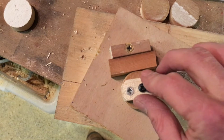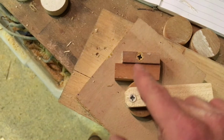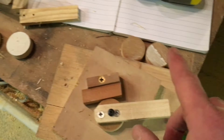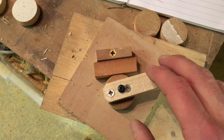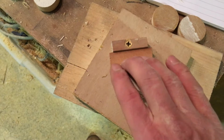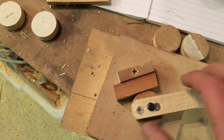So yeah, that's what I'll do. I'll set up on the curved piece, the steam bending part, once I've finally bottomed out what the curve is supposed to be, I'll set up a bunch of these blocks. I've got six, I think six points probably will be enough to find the right position. So I'll set up these blocks, I'll set up these cams, and then I can basically pull it out when I've steamed it, drop it in, and then whack those tight and leave it. I think that makes sense. I might have, as I said, over-engineered it a bit, but there's no harm in that.